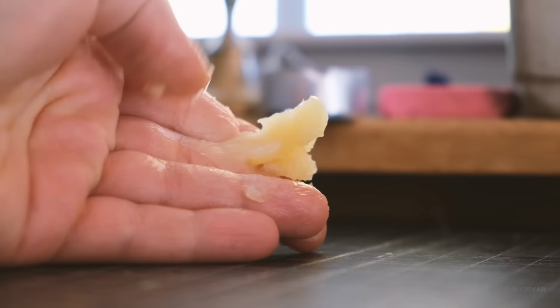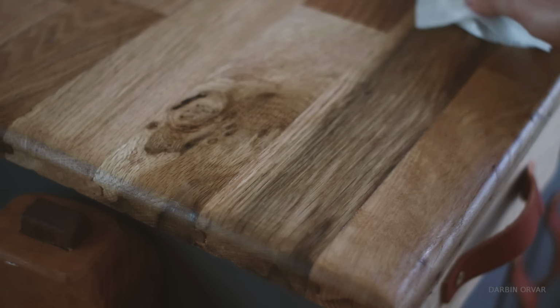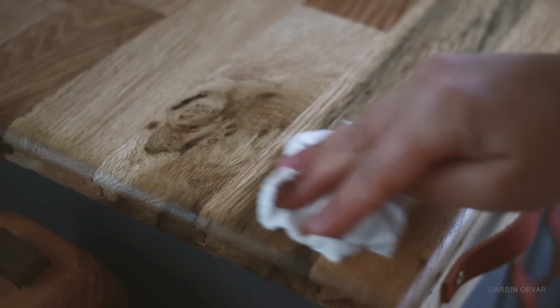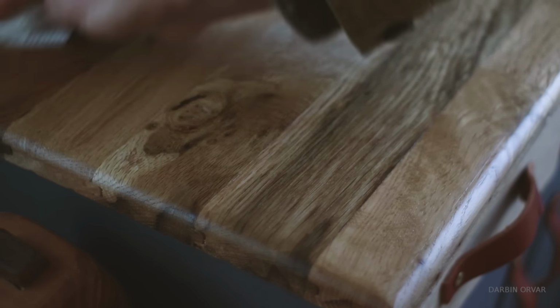You may not know what I'm talking about if you've never worked with wax, but wax really creates a very interesting, soft, matte smoothness. It is really nice. My favorite combination that I often use on projects is to first finish with de-waxed shellac. It's natural and it doesn't smell too bad, and it dries really quickly. Once I have applied 1 or 2 coats of that, that's when I put on my wax polish. And that's my go-to finish that I use a lot.